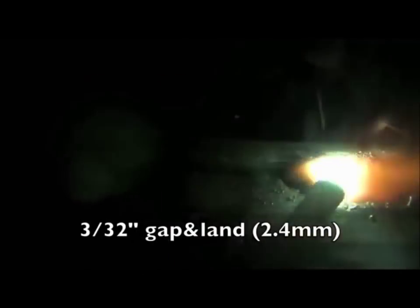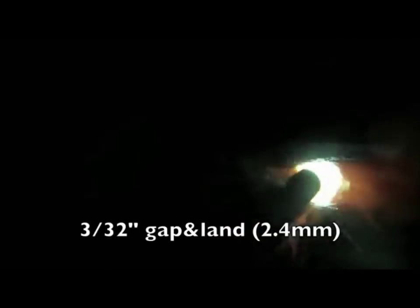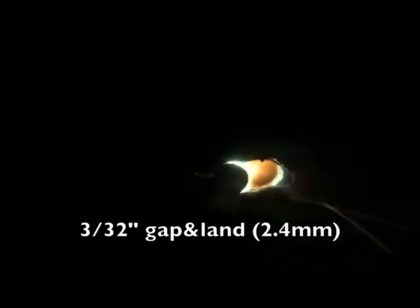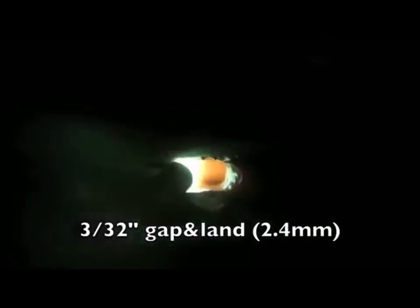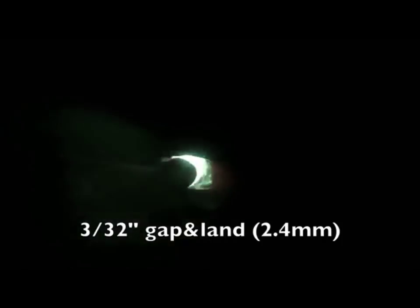And when you light up on a tack, the way I do it is I long arc it to begin with and get that tack heated up, and then gradually tighten the arc up, and then when I get to the end, just jam it in there pretty tight and get that keyhole going. Now I've got the rod. I'm scooping out metal as I go forward. I can feel it scooping out metal, and then I go back into the puddle and try to keep it pretty tight.